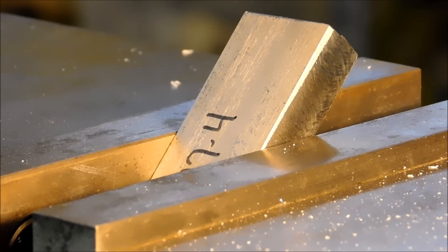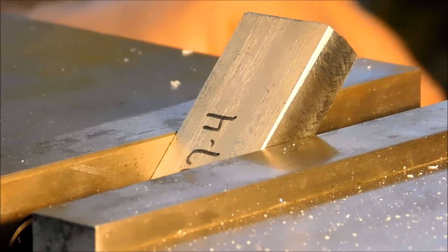Okay guys, for sake of this demonstration, I'm going to use a piece of 1.5 inch by 1 inch 17-4 stainless, and I've got it squeezed in the vise at approximately a 45 degree angle. The angle for this demonstration really isn't critical, because any angle is going to influence a drill in a way that you don't want it to be influenced. So if we were to come down straight on this surface with a drill right now, it probably wouldn't end up well.